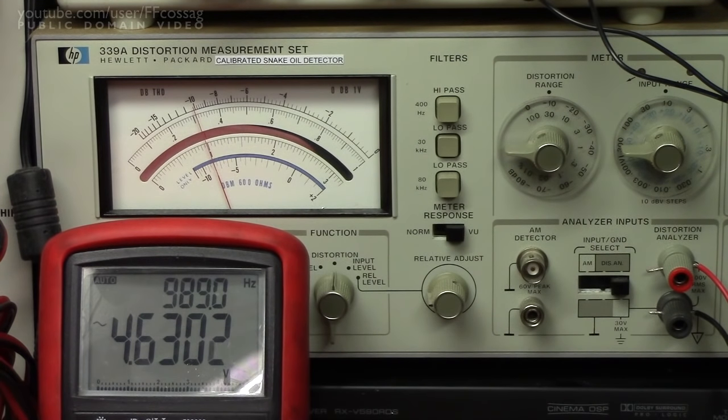That's pretty much 5 watts. So the performance of this amplifier is pretty much 2 orders of magnitude below what the advertisement claimed — not much to anybody's surprise, but this really is piss poor. You'd get 4 times more power out of a Raspberry Pi, which costs like $8 more at worst. I really cannot recommend this amplifier. With that technicality out of the way, we can be pretty certain that the internals of this amplifier are going to be pretty crusty.